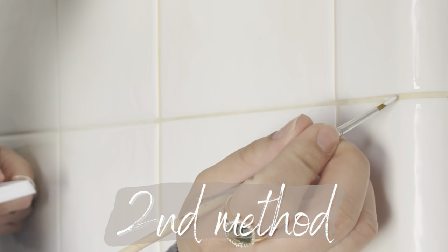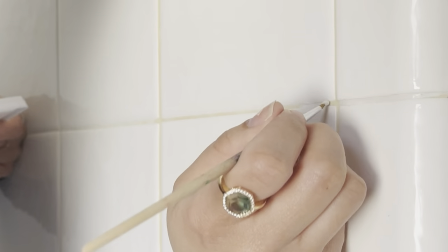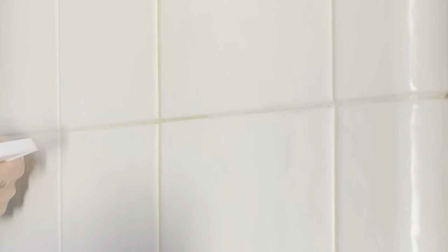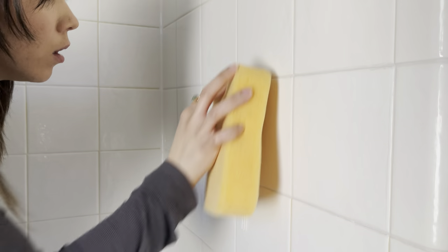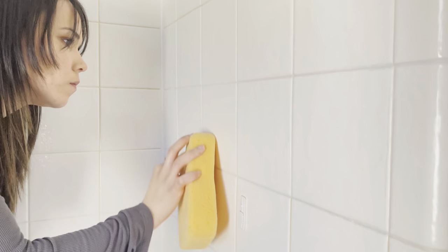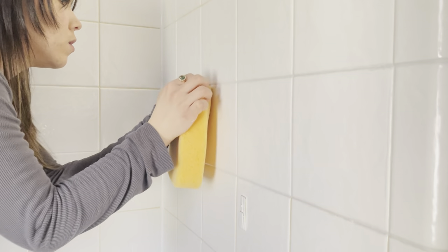Here I'm taking a really fine-tip paint brush and trying to apply the product into the grout without making a big mess. I wanted to see if taking our time rather than applying it messily would be quicker. It is not. With the toothbrush it applies better and more evenly. With the paint brush, since it has very soft bristles, it doesn't apply evenly and needs another coat. As you can see, this small section I just did — the first one is already dry and not coming off, but over there it's coming off from the grout too, which we don't want. This wiping method is not efficient at all.